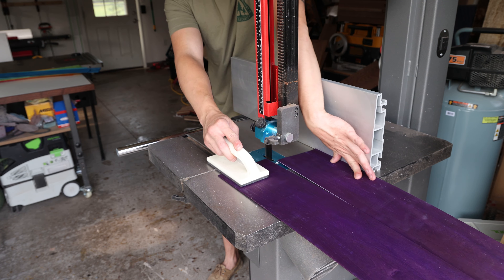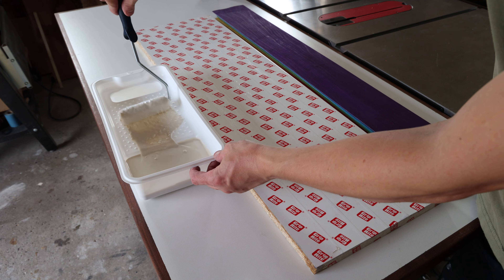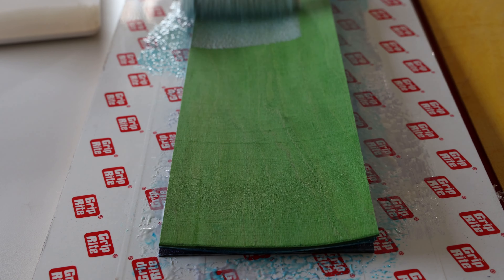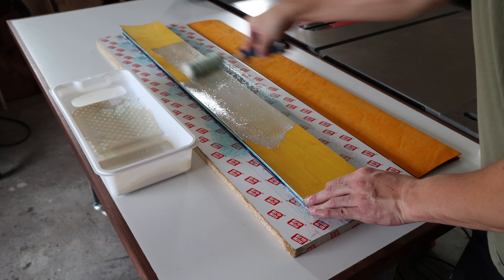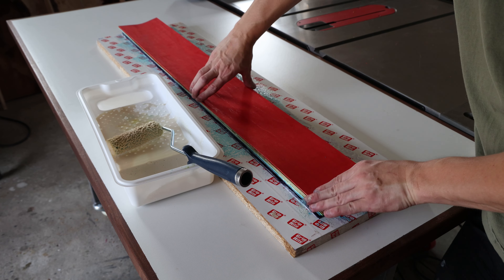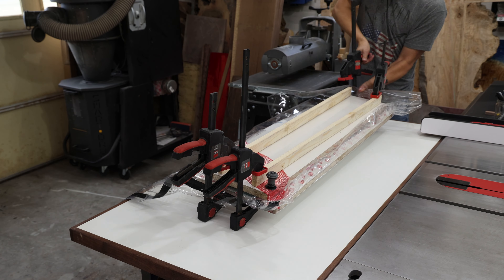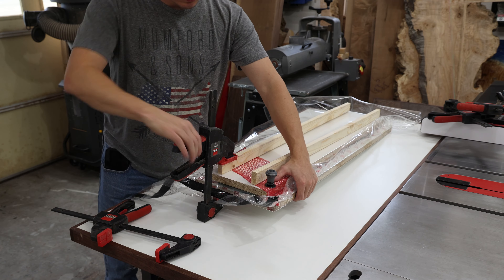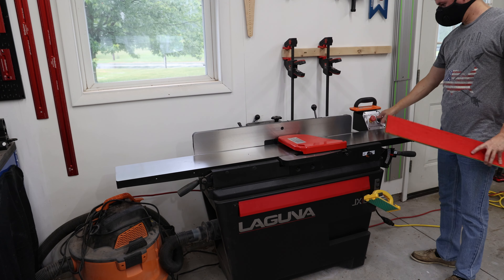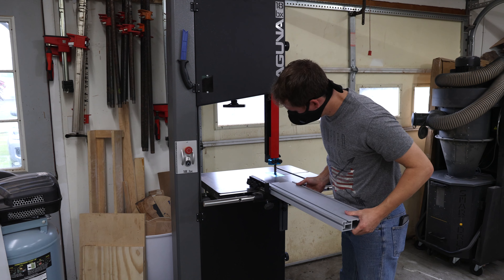We spoke for about 20 minutes and he filled me in on all the tips and tricks to have a successful lamination. I realized that doubling up each color and having 16 veneers in the piece looked too busy, and Ted mentioned it would be easier to rip each of the pieces in half. The biggest bit of information he provided is that epoxy isn't the ideal adhesive for these applications. A PVA glue like Titebond 3 will actually soak into the wood fibers, making the material more malleable — which is likely to create a flatter lamination — and when soaking into the wood rather than sitting on the surface, you don't get those prominent seams. Demolding this second lamination was quite the relief: no mess, no cuts, and the aesthetic was spot on.